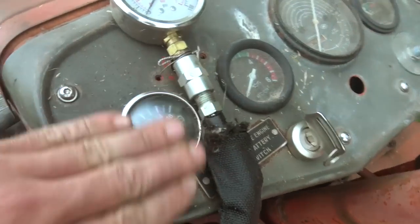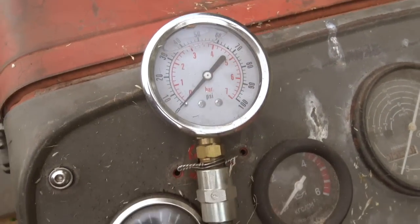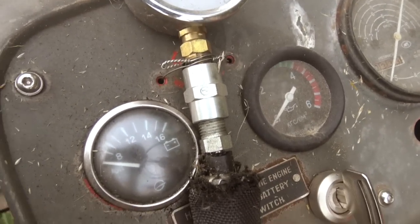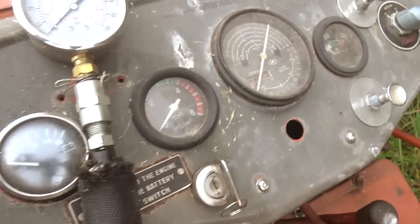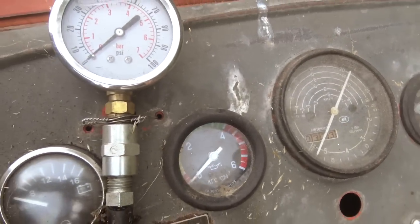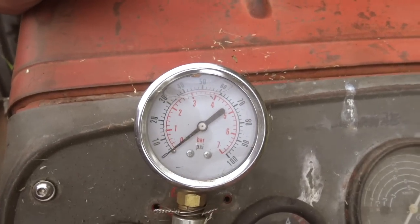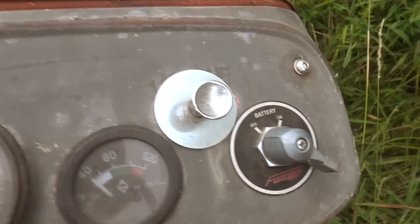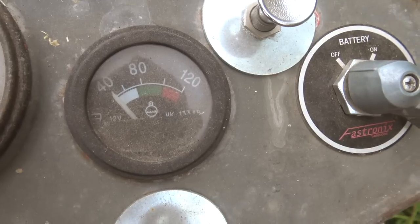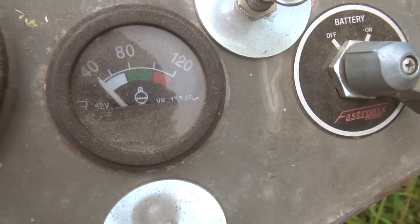For gauges, I got a little creative with that — just a standard generic aftermarket 12-volt deal. This gauge is for my oil pressure, actually from a surplus center, believe it or not. Those are standard hydraulic fittings with just the usual rubber hose. That oil pressure gauge actually randomly started spewing oil everywhere, so I fabbed this one on when I needed to get the tractor back in service. It's got this temperature gauge — I'd say coolant gauge but obviously it's an air-cooled diesel. It reads in metric and you can see there are some Cyrillic characters written in there.